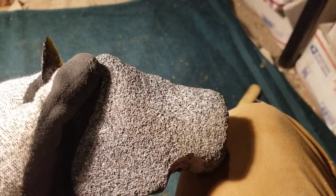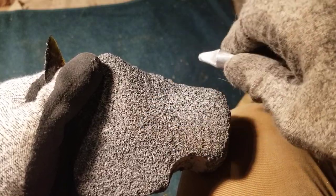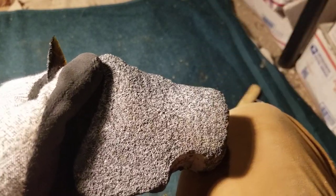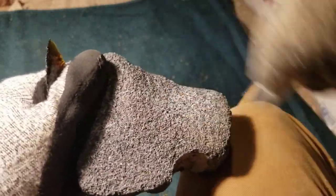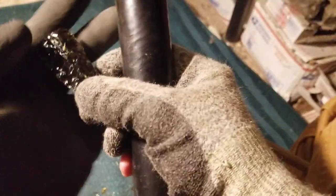Anyway, I think it's better to use a grinding wheel to dress the tools, because you get embedded glass and flint in the tip, and when you use a file, you chip the metal in the file if you've got stone embedded, right? So it dulls the file. Anyway, this will take care of those rock chips. Theoretically, anyway. I don't want to say for sure because I don't know for sure. I'm kind of guessing on that, but that's why I do it. I don't want to dull my file. I don't want to spend more on these tools than I have to. Okay.